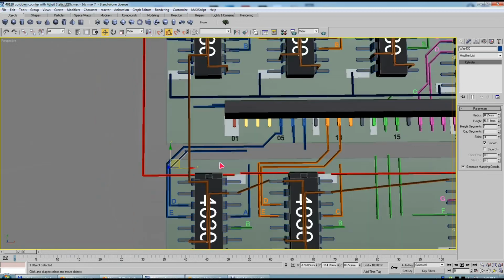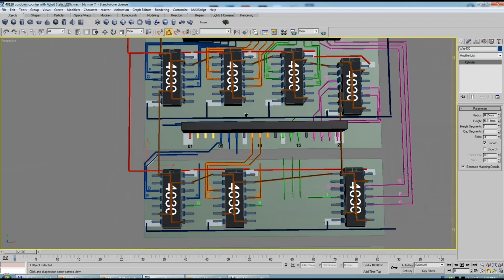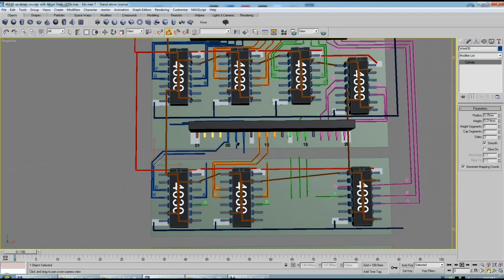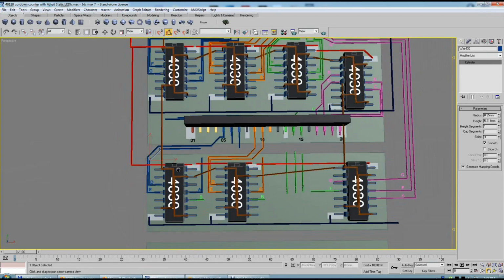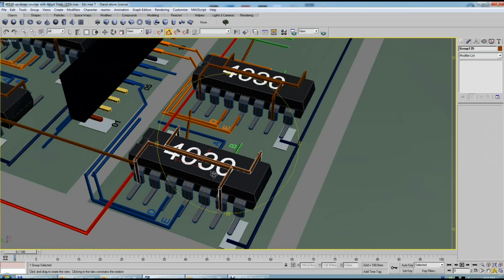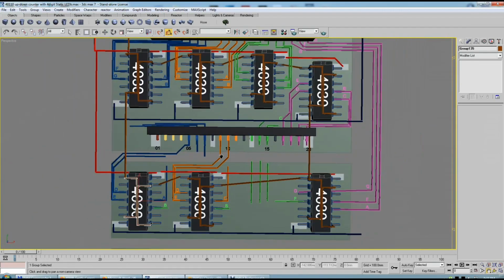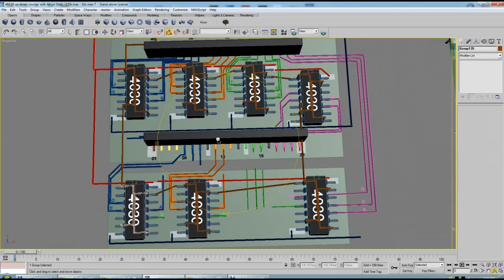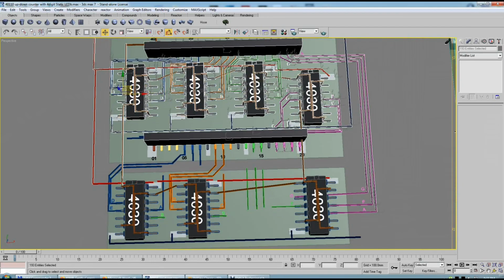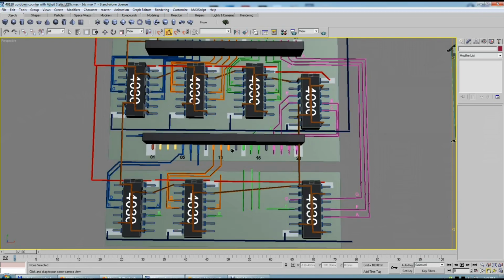I decided to actually show how I'm making this continuation. So I took out all those small XOR gates, and I put in these larger chips, and I remade this link, as you can see here, exactly as I make it in reality. And now I've made up my mind. I keep the same configuration as I originally had, with the exception that I will take out those little buggers from the bottom and the top. But I will keep the positions because all the wiring is already there.